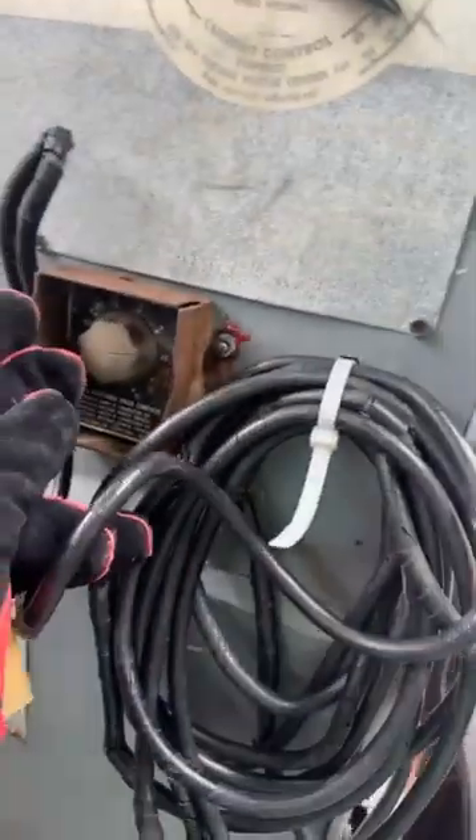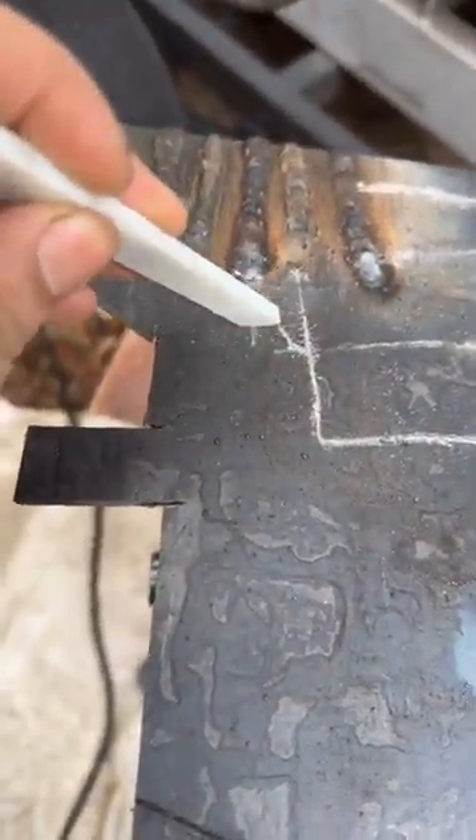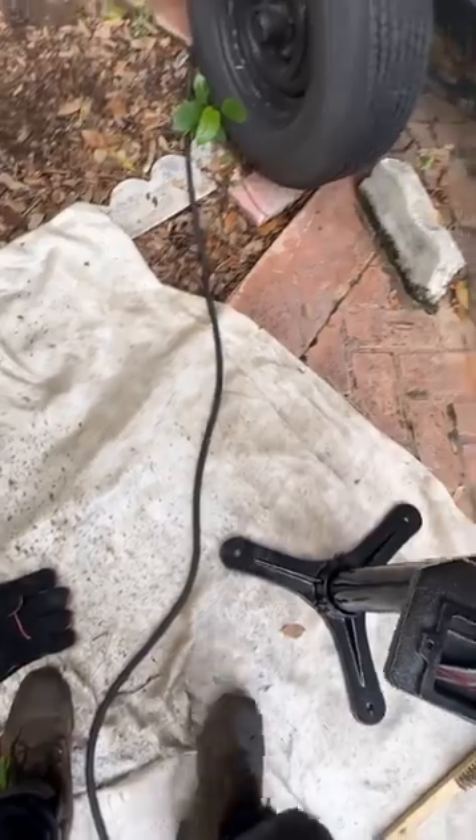This machine is different, so I'm just testing the amps to see what works better. So far it's at 85 — I'm thinking a 6. Let's put it up a little bit, I know it's going to be a bit too hot. Each machine is different, you know what I mean? You waste more time trying to figure it out, how hot it is, so I've got to put this on record. So both of them are 6 and 7, and then 6 and 8 — those come out nice. The 5 and 8 didn't work out that good, so 6 and 8 and 6 and 7 are the right ones. So whenever I'm actually doing some welding I don't have to go back and forth.